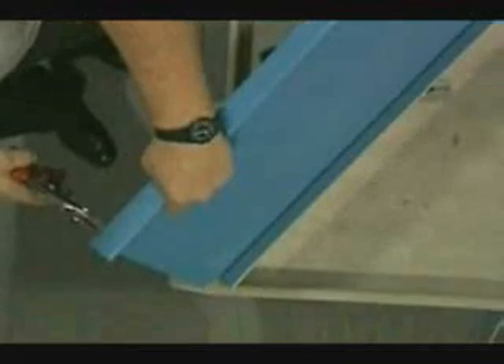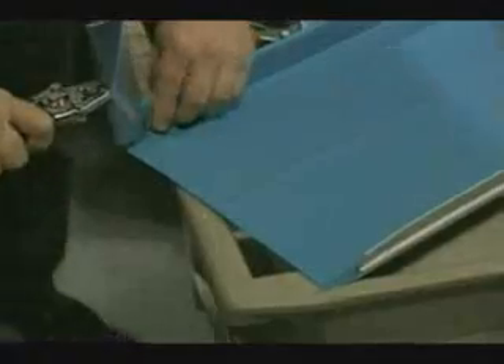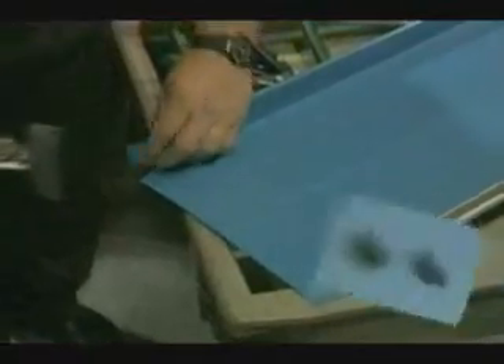Next, we will cut the outer edge of the high seam and then fold over the inner edge toward the outside. This will close off the end of the seam. This can also be done using an end plug in a matching color which can be provided.